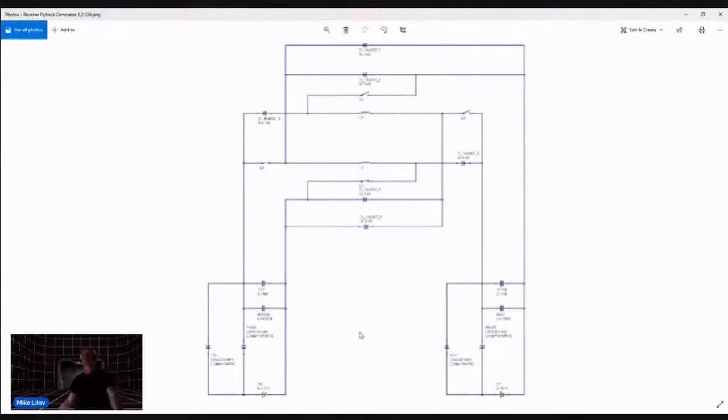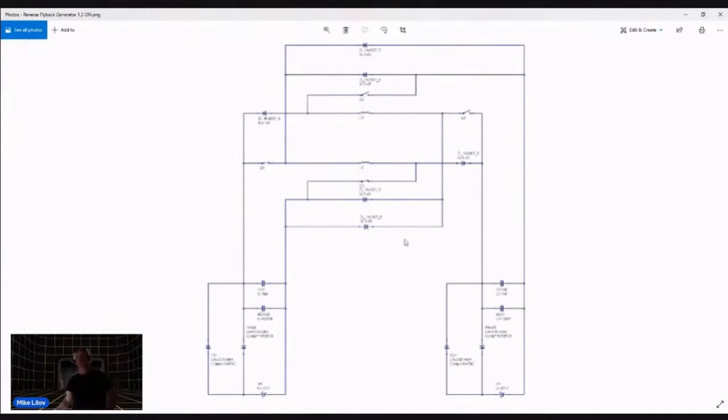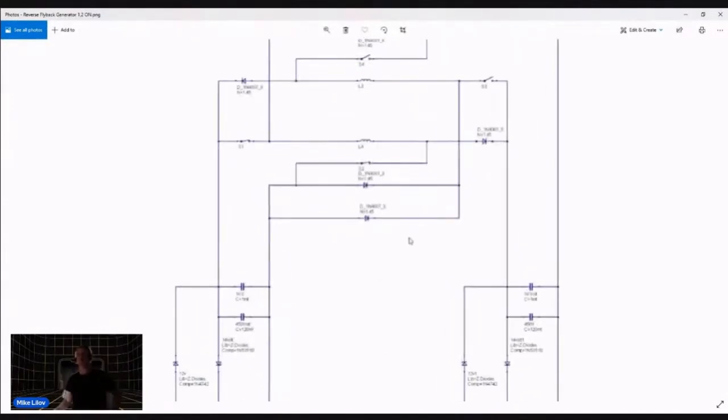There's two batteries in his system, and there's one bifilar. One of the windings is the trigger winding, that would be the thinner gauge, and the thicker gauge is the drive coil. And in the Bedini system, the thicker winding is the one that receives power from the battery.